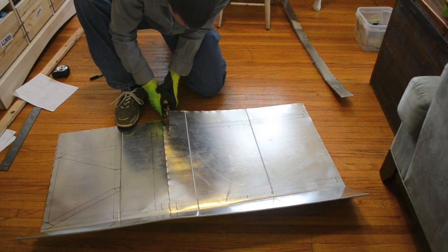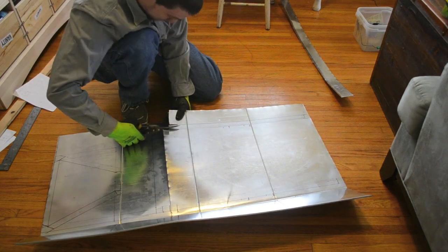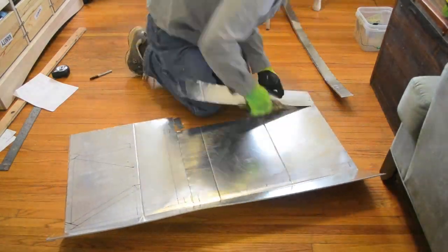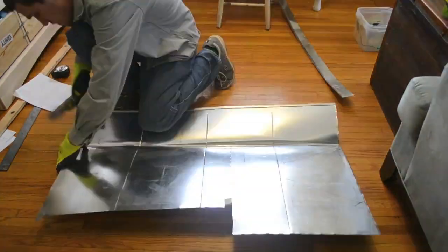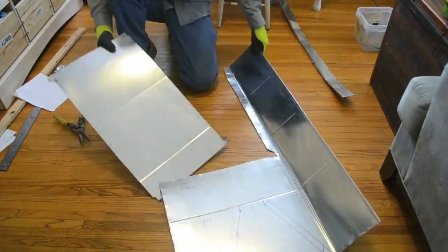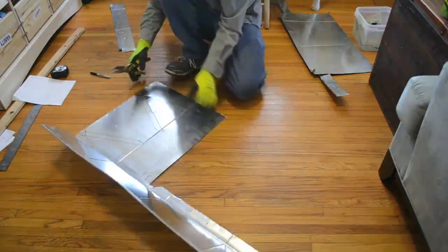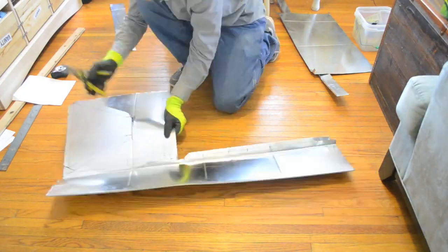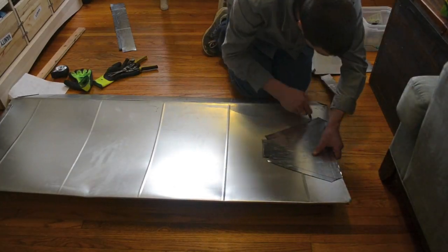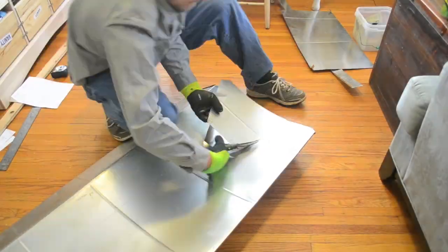When you cut out the back panel, cut into the side an extra 1/4 of an inch so you can fold over the side edge later. This will leave a 1-inch square tab on each corner that you can fold out of the way to make your side cut. After cutting out the first side, use it to trace out the second side and cut it out.